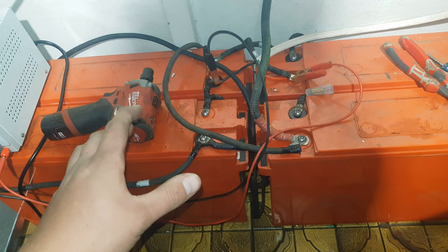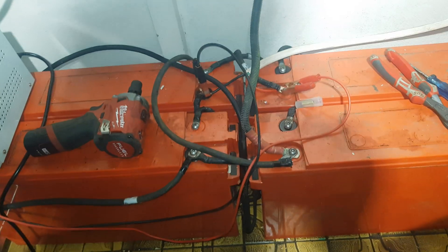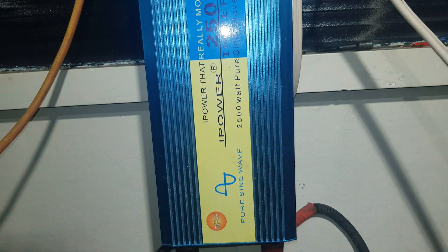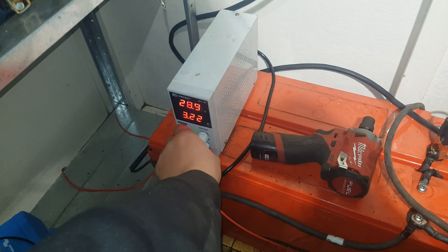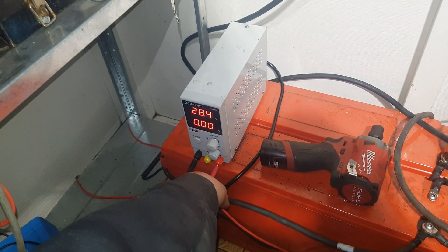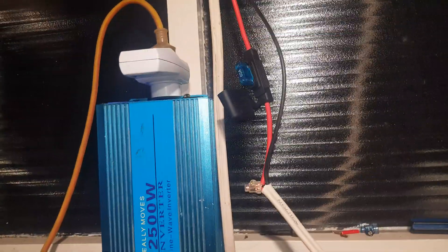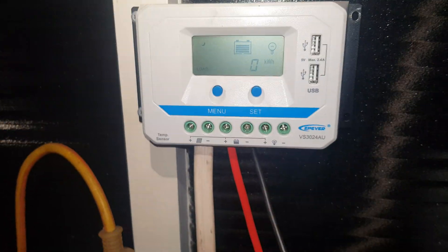So we've got our four SuperSafe SPS 190Fs in here. I just found on the internet the other day that these were $900 US dollars each when they were new — crazy. So out of the shed we've retired a 2,500 watt pure sine wave 24 volt inverter. We've got these in a 24 volt configuration, 28 odd volts of charge at the moment. We have just the single DC incomer there which goes up onto this roof — just a single 250 watt 38 volt grid type panel — into the EPever VS30-24, so it can do 24 volts and up to 30 amps.